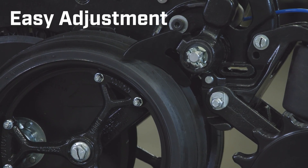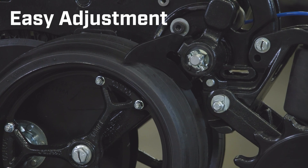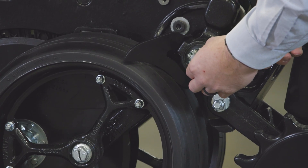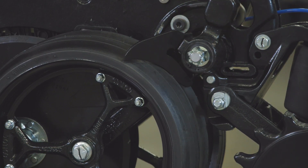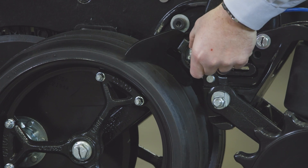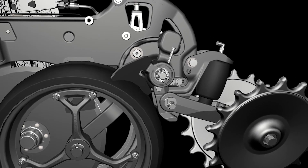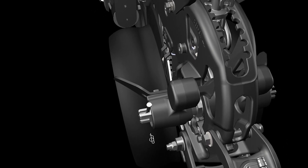You can see the large retaining nut on the outside, which adjusts this gauge wheel arm. You really just need a small needle-nose pliers — there's a double spiral clip in here that you can rotate and pull out. You're going to take this pin out of the mix, and then you simply rotate this nut in or out to adjust the tightness of your gauge wheel to the outside of the disc opener blade.